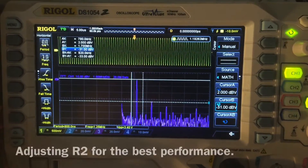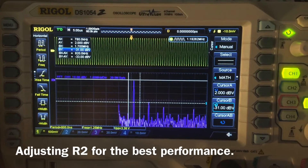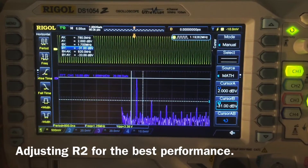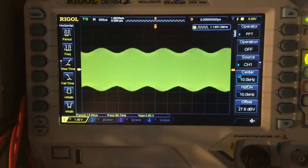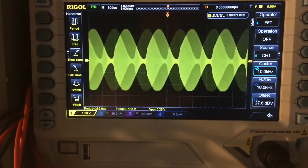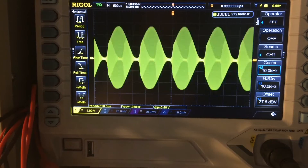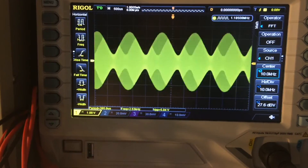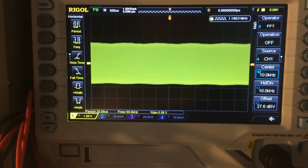Getting the feedback in place, you can see the first harmonic is around 33 dB down — so really a clean transmitter. The same holds true for the AM modulation: I can modulate it up to 100% or more before it starts to clip, so it has really nice AM modulation characteristics.